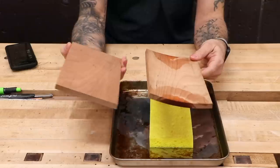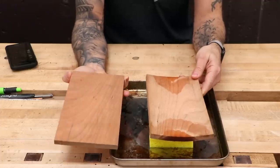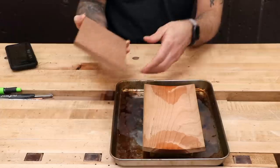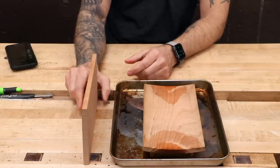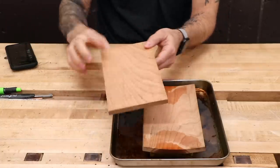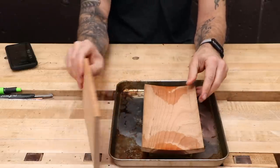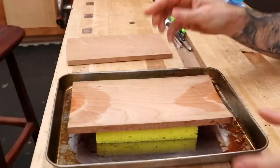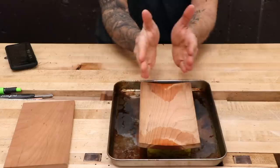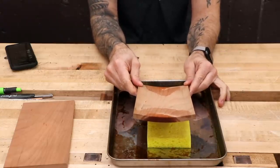In this example I took two roughly identical boards — alder planks soaked in water overnight until completely waterlogged — to show what uneven drying can do. For one board I laid it on its side overnight, letting air get exposed to all the faces and ends, and as you can see it stays mostly flat. The other board was dropped flat on a moist sponge, keeping one side wet while the other side dries. Those fibers contracted as they shrank and pulled the sides up, giving you a pretty wicked cup.